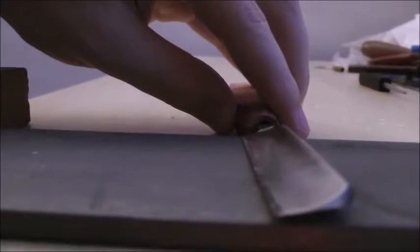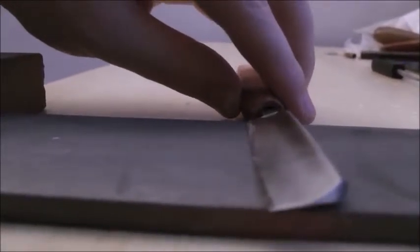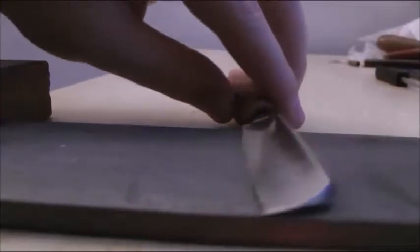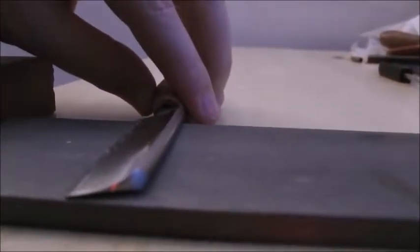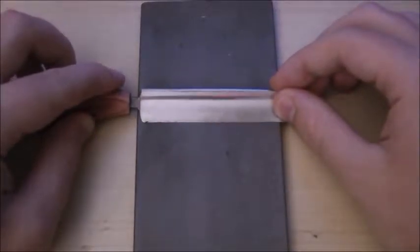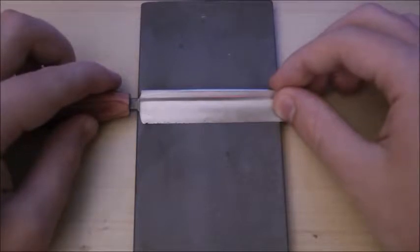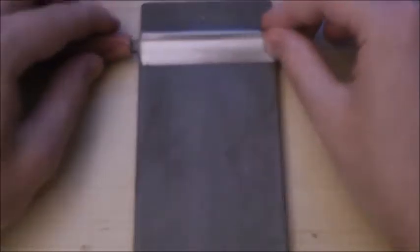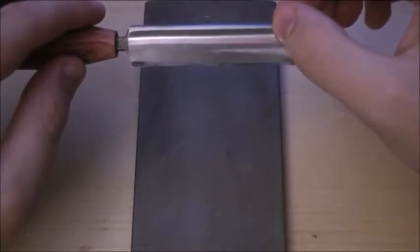I'm not applying too much pressure — you don't want to have to strain yourself doing this; it shouldn't hurt your wrist afterwards. When I first use the diamond stone, I'm using maybe a medium pressure going forward and then a medium pressure going back. I'm lifting the knife at a small angle, like 15 degrees. I'm realigning the burr so that it is on the back side of the knife — the side that is towards you when you're scraping. Medium pressure going forward, medium pressure going back, and you'll start to see metal shavings come off.